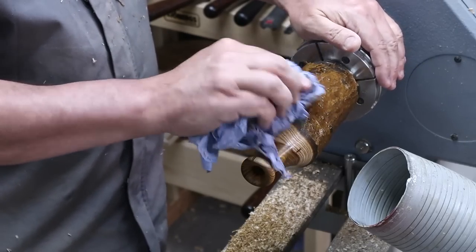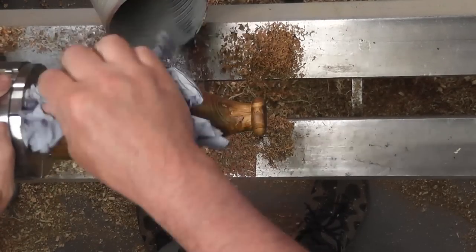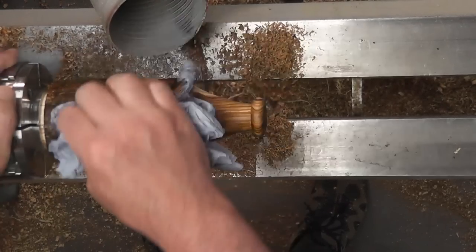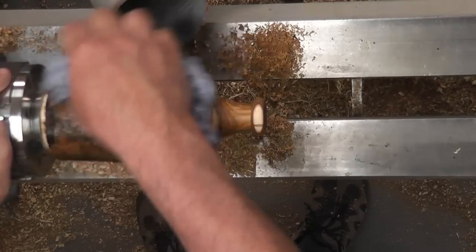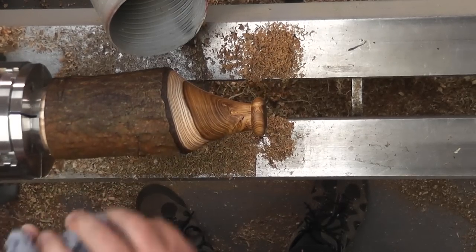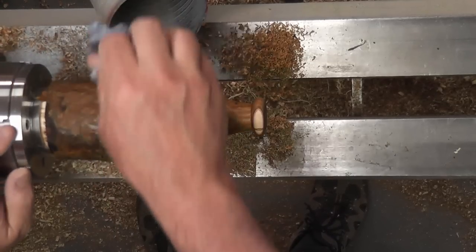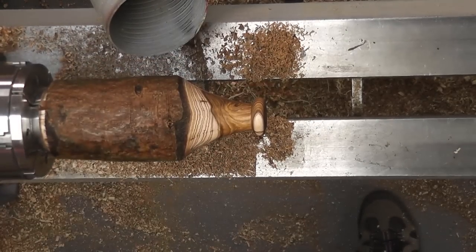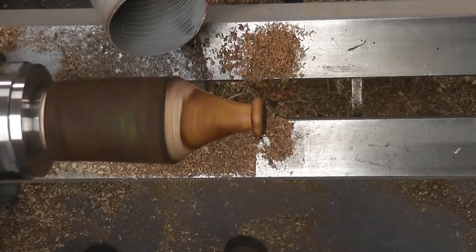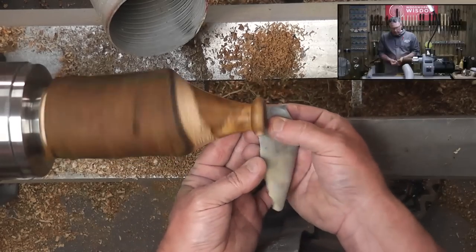There we go. Oh, that real leather look about it. It's lovely. Now, ideally, you want to really leave that. Let those thinners dry out, evaporate. But I'm not going to make you sit there and watch paint dry. So we're going to just very slowly have the lathe running. I'm going to sand the solid area.